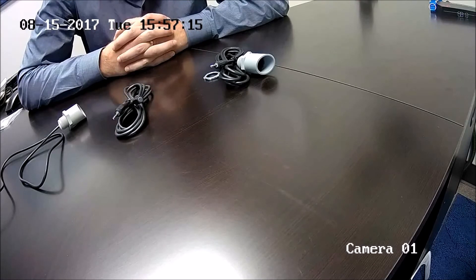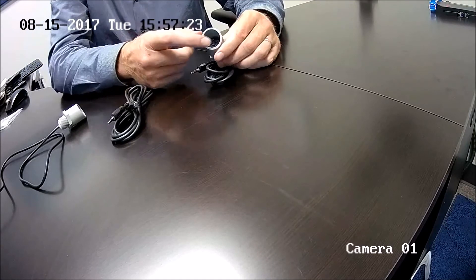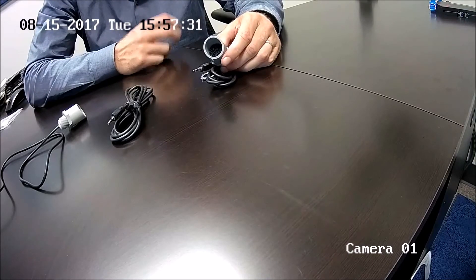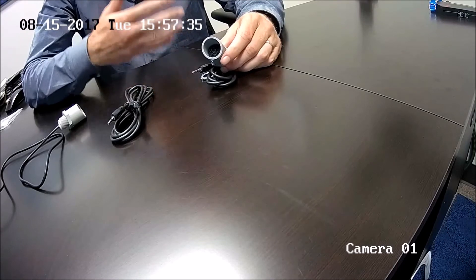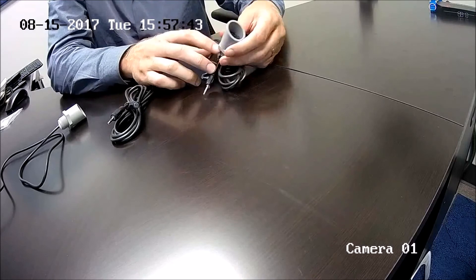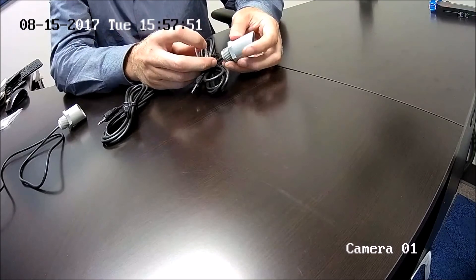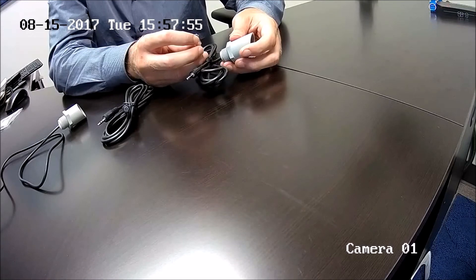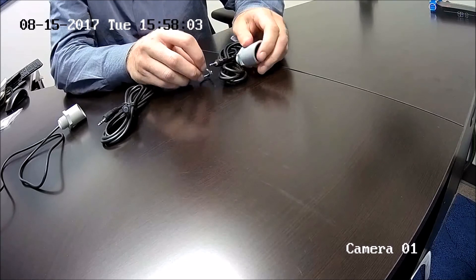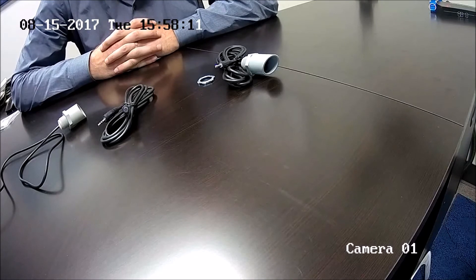This other microphone is outdoor rated. What's cool about it is there's a foam windscreen — you can pull that out if you want, but it basically protects the microphone from wind noise. It also screws into a half-inch grommet knockout hole. So if your camera is mounted near a junction box with half-inch holes, this screws directly into that hole. There's also a locking nut to lock it in place — great if you're running RJ45 connections through electrical junction boxes.